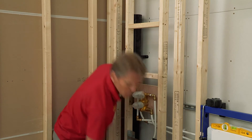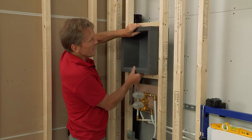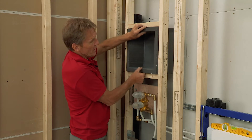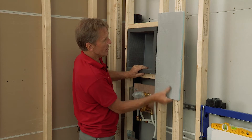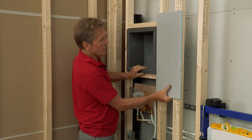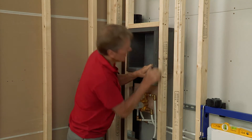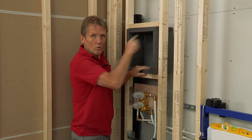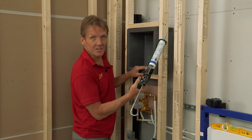Here's a much better ready-made solution which fits directly in, made for the job, and it'll go into that 200mm void and then we just bring it flush to the front with the board. The great thing is we don't need to worry about breaking that waterproof structure with anything because we can put it in with our adhesive.